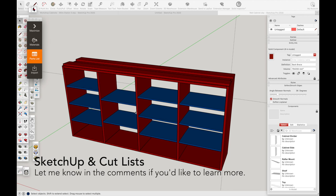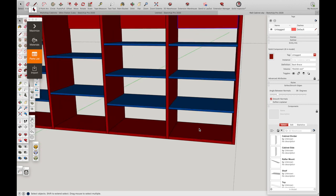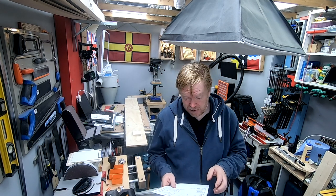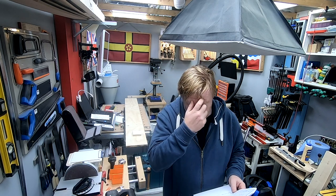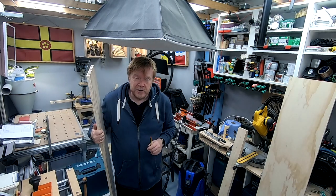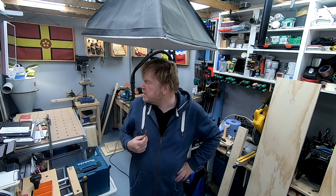I've already looked at the problem. I measured the wall again and rather than being just shy of 1800 millimeters, it is 1775 — quite a discrepancy. I'm not entirely sure how I managed to measure that wrong. I now have a new cutting list with overall dimensions of 1766 millimeters, and a bunch of components that all need to be cut to 419 millimeters. I can use the flip stop on the Bench Dogs fence to do that.